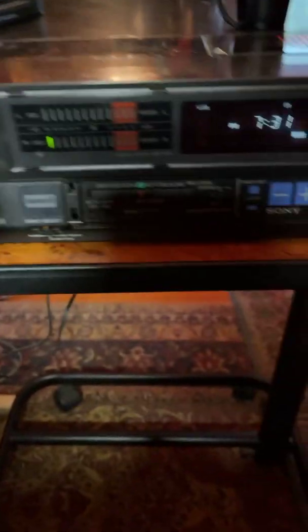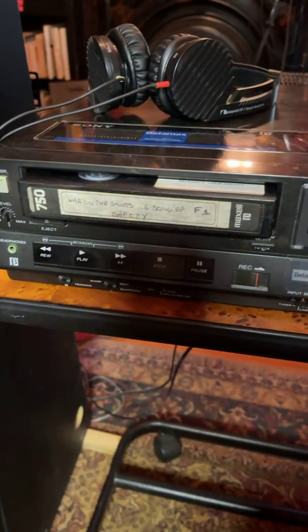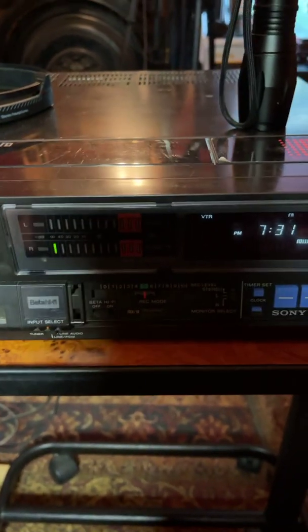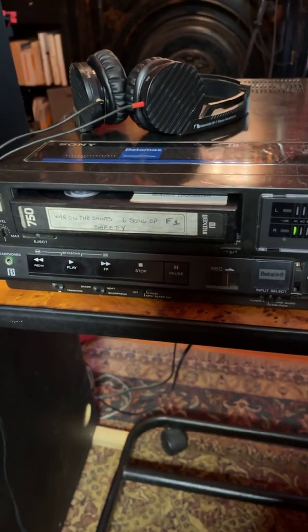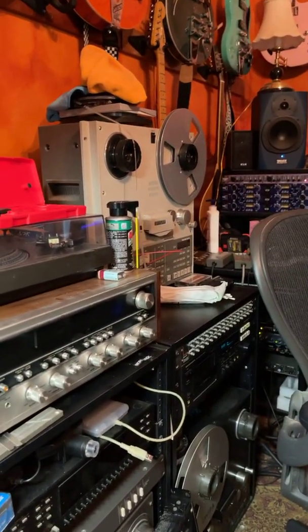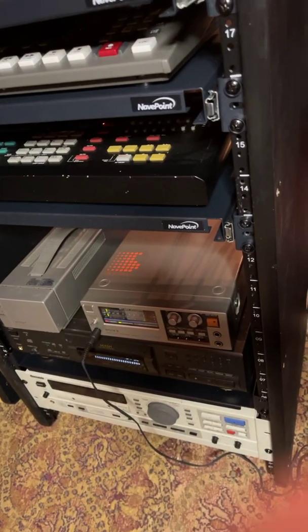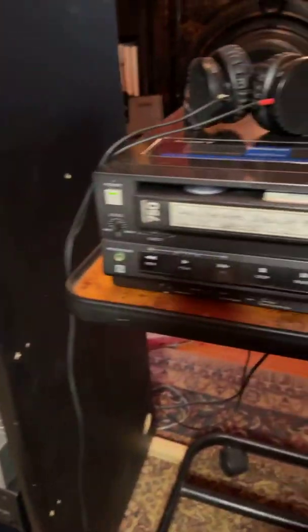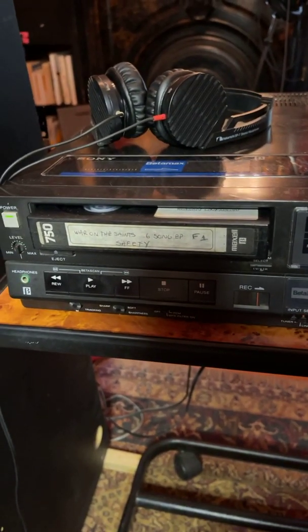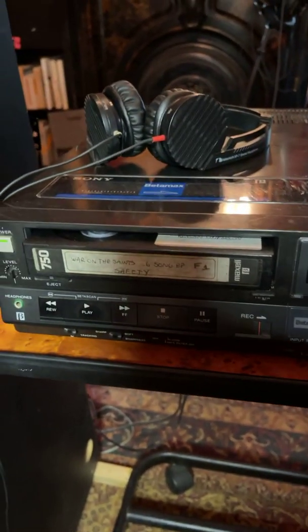You're saying, how does that work? Because those machines weren't stereo, and isn't video terrible quality? Yes, it is. I used to hear people telling me they were recording to the audio inputs of VHS and Betamax machines and using those for mastering. Well, that's not very good audio quality — it's not really any better than cassette, and certainly not better than one of these machines at 15 IPS, well-tuned up. The audio tracks on these machines were mostly mono back when they came out with this idea, and they weren't really high quality.